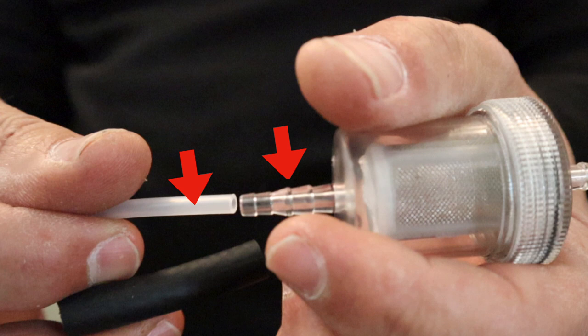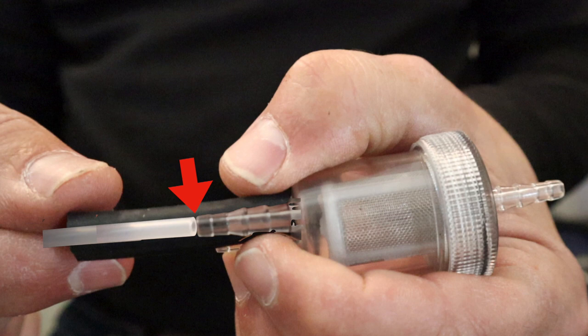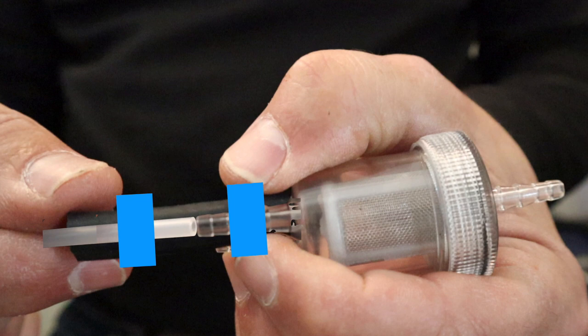The fuel line and the fuel filter have to touch each other. They are inserted into the rubber tube so that they connect and are touching each other in the tube. You do not want to have a gap between the elements, because if you do, an air pocket will form there and that will mess with the fuel dosing level and cause some fuel problems and smoke problems. Once they're connected in that rubber tube touching each other, you simply tighten the hose clamps and you should have no leaks in your seals. Here's what it looks like on the filter now.